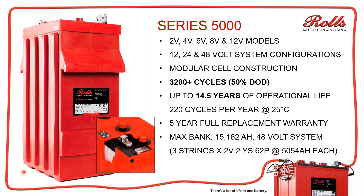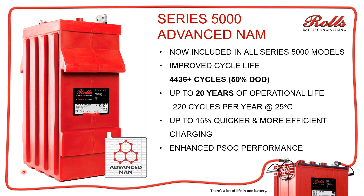On the Series 5000s, we were typically seeing about 3,200 cycles at 50 percent depth of discharge, with an average life of 10 to 15 years — realistically about 14.5 years at 220 cycles per year at 25°C. The Series 5000 batteries now see almost 4,400 to 4,500 cycles, giving about 20 years of operational life. One thing we were excited about is that we were able to produce and ship these — this is being recorded on July 19, 2019, about a month and a half after we started shipping — and we have not increased prices on these batteries. The price in March is the same as May 1st.